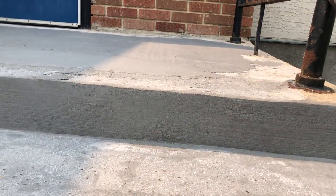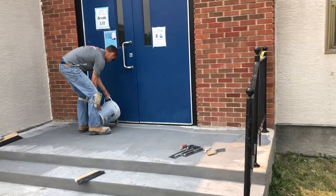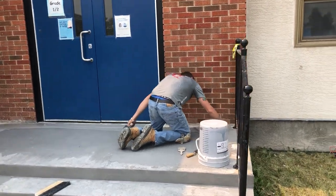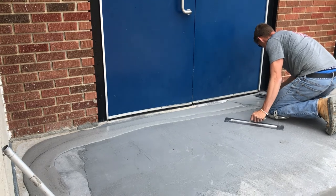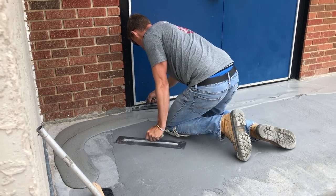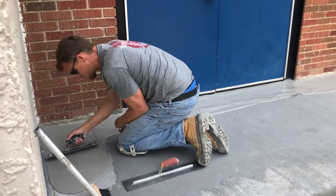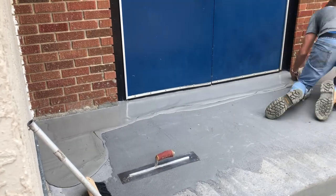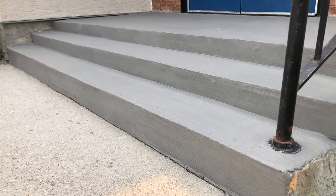We have the risers all done and we're getting ready to skim coat the entire staircase. We also put in more product up top — I wasn't happy with the level of that upper pad, it was going to be pooling water — so we poured more structural, used the screed, and filled in the low spots. Now we're doing our final overlay. As you watch throughout this video you can see we're using many different mix consistencies with the TF Structural — wetter for thinner applications like we're doing here, and drier mixes for the deep forming. We also added aggregate to the form material.